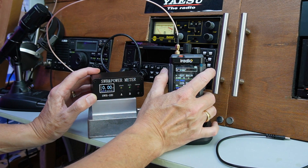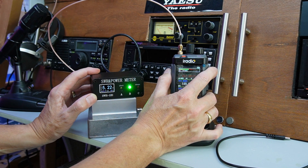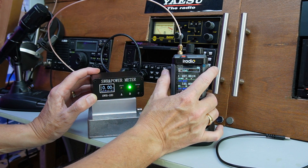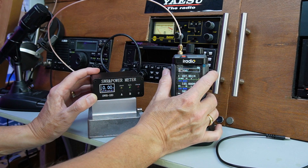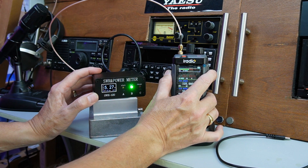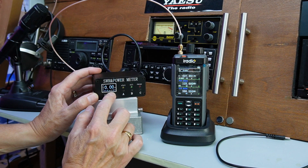Let's key up for the first time then. Here we go. Oh wow, look at that go - 5.25! SWR 1.16. Going up to 5.3. So it is more than I thought - that is a lot more than I thought. 5.25 watts, 99% power transference there.